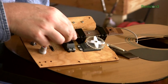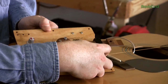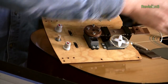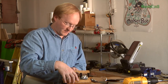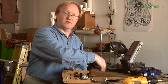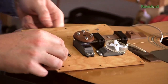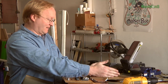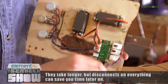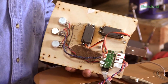Here are the parts. We have this, which moves the strummer back and forth. This goes forward and back to lift the strummer off the strings or let it hit the strings. Then we have this, which tells us if we only want to do up strums or down strums. And this one — the strumming is manual, so it's controlled by the foot pedal. These are pots that adjust how far it goes this way and how far it goes that way. Underneath, we have all these nice disconnects. This wire is coming from the connector that goes with the pedal, so it's easy to take apart and modify as needed.